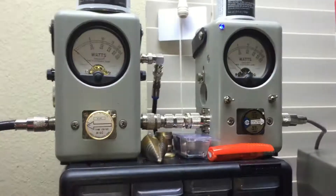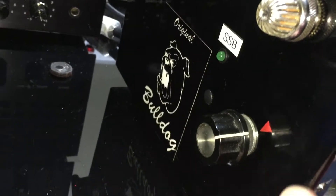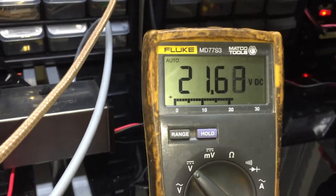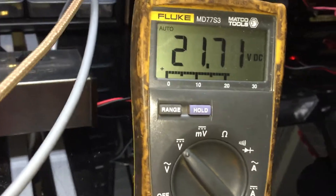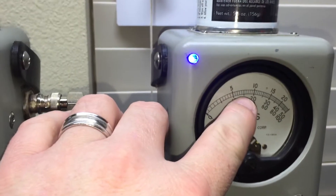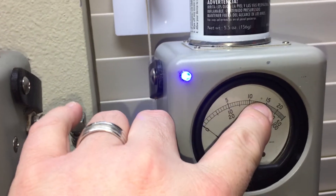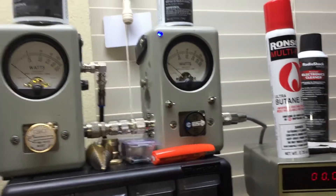Fluke, 99V, Bird Collection — let's go ahead and get on with the show. We're running about three quarters of the way. Floating 21.6 — it goes 21.5, 21.6, just depending how you key. We do have the 99V about a quarter of the way. That's 1,000 — between there it's 1,250, and then of course 1,500. We should be about 1,250 PEP. That's a 500-watt coaxial dynamics times 5.